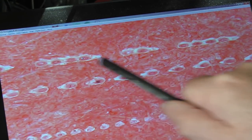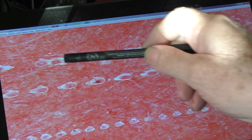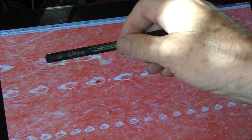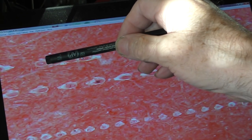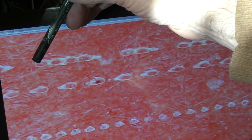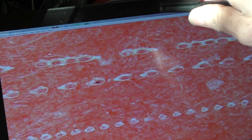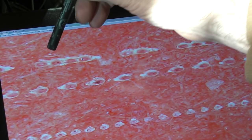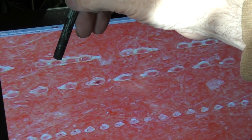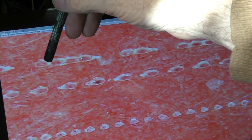I mean, I'm doing 1000 millimeters a second here. So this is running pretty fast, and it's still switching on and off instantly enough to show that I've got virtually no, if you like, power build-up. There is a little teeny-weeny bit of power build-up here, because look, you can see the beginning of the pulse. If you like to regard that little white bit in the bottom there as being maximum power, then you can see that it is slightly shorter than probably 100 microseconds. But the overall pulse width here is about 100 microseconds.